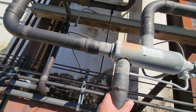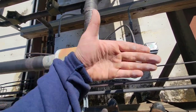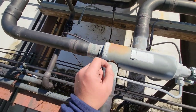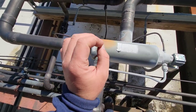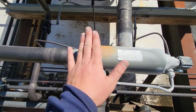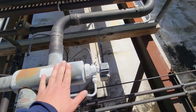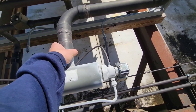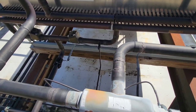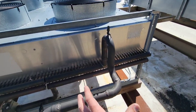Now this split valve — you can see one side is hooked up to high pressure, the other side if we follow it is hooked into that pump down valve. Because when you put it in split, if there's all this pressure over here it can't slide to close it, so it needs to evacuate that pressure and put it into that pump down over there, which is a lower pressure. Now on this side when this goes off, it uses this pressure to push out the piston — and there's probably a spring in there also, this is just kind of an assist. So what's happening now is: this solenoid being on closes off this side of the condenser, and that check valve prevents any liquid from going into it.